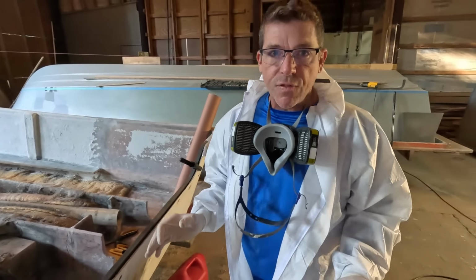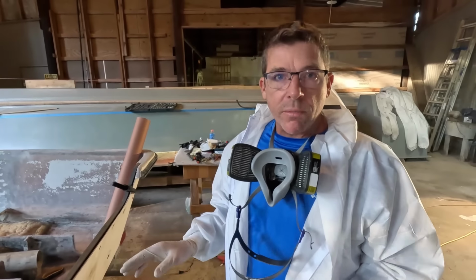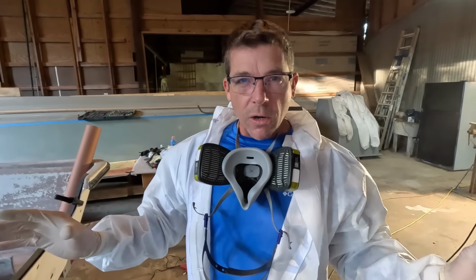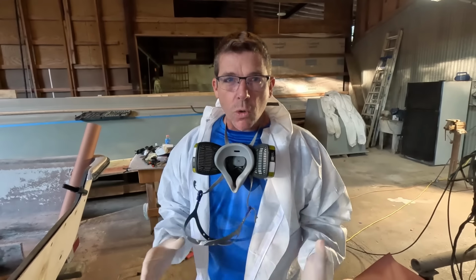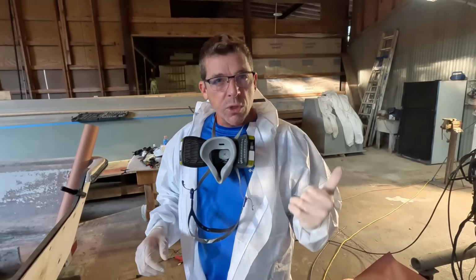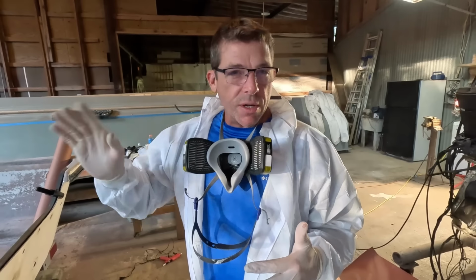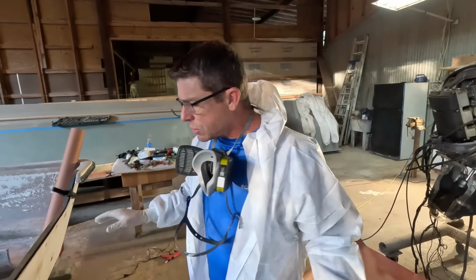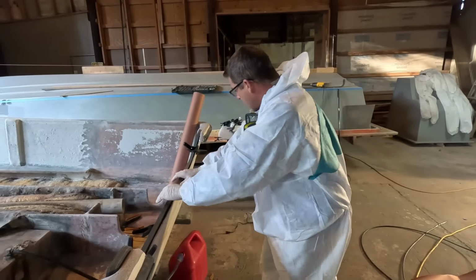Now, this transom was originally 2 layers of 1/2-inch plywood, but it is important to remember, like with the Coosa, you want to go with a 26-pound density. That is their recommended for transoms. And even on bigger, more powerful boats, they have a 32-pound density transom core. Their 15 and their 20-pound densities are going to be more recommended for like stringer applications or floors or bow decks and rear decks. Although when we were building our 29, I used the 26-pound density, or the Blue Water 26, exclusively for the whole thing. So I'm pretty happy with this.